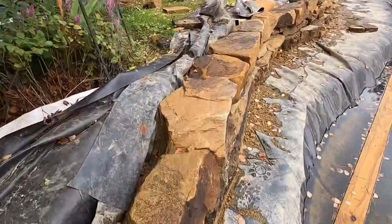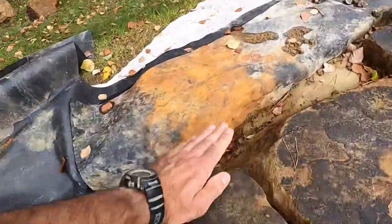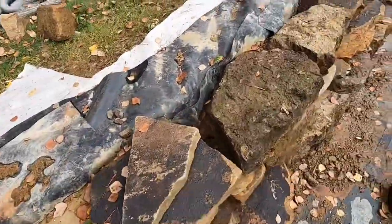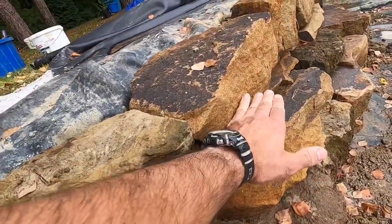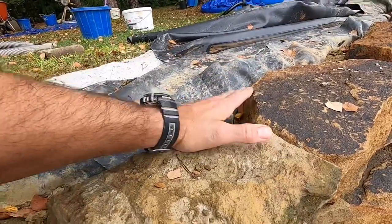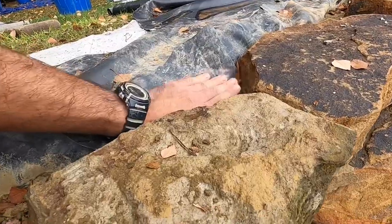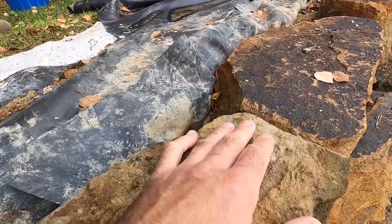Dave's task today is to backfill all the voids with concrete to about an inch or so below ground level. The important thing is that the filling has to be higher than the maximum water level — it's tempting to chuck soil in here, but once the pond is filled up these voids will contain water too, and soil will soak away, reducing the water level. So this needs to be filled to just above water level but just below ground level with cement or concrete, then once cured a layer of soil and turf can go on top.